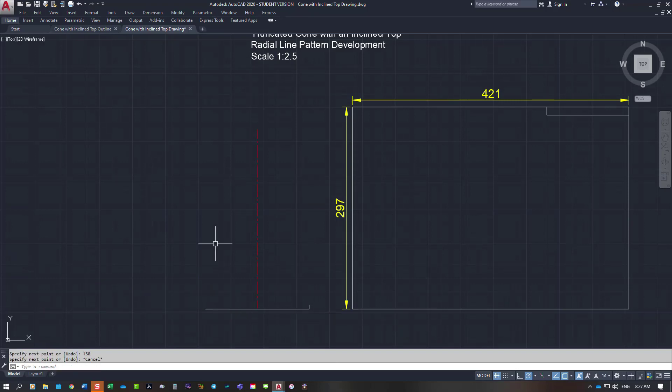The vertical height is 500mm, and dividing 500 by 2.5 gives me 200mm, so I need to offset it 200mm high. For the 100mm OD at the top, minus the 5mm gives 95mm, and dividing 95 by 2.5 gives a diameter of 38mm at the top. So I need to offset either side of the center line by 19mm.